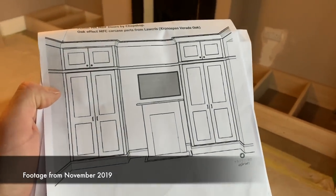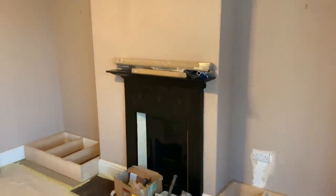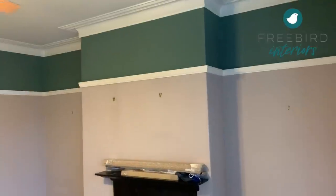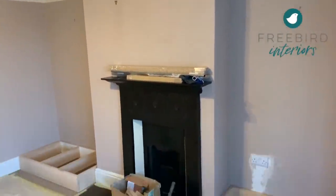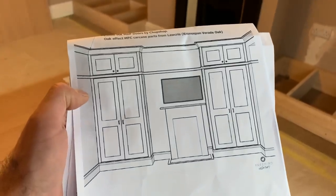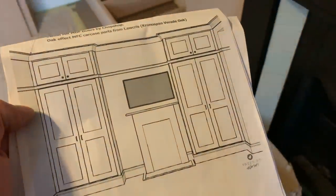What we've got today is a more traditional pair of wardrobes to go in this space, and we're building these using the same construction methods that we use for alcove cabinets, which work for wardrobes when they're two doors wide or less. We're using inset hinges which should throw the doors within the carcass, and then we're putting cover strips over the edge which ends up at 54mm.